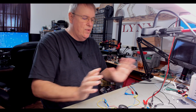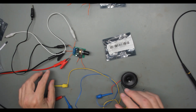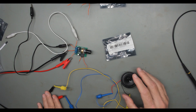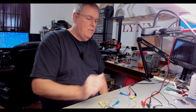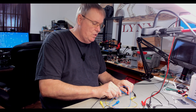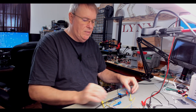So I'm going to pick up where I was when I discovered this and just redo that part. I've got the LM386 here and I want to see how much amplification we can get out of it. I've got it hooked up, and I've got my signal generator set up with a one kilohertz signal hooked to the speaker. I want to play around with the amplitude, find the lowest level that will barely drive the speaker, then run it through the amplifier and measure the audio output with the oscilloscope to see how much signal we're getting.